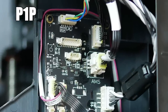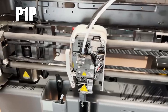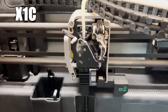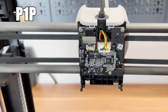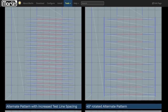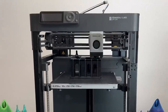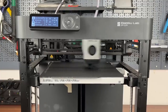That's mainly because of restrictive limitations. The toolhead, including all PCBs and interfaces as well as the front cover, is proprietary for the P1P. Electronic parts for the toolhead — like temperature sensor, heater, extruder, the fans, or hotend assemblies — are not interchangeable between P1P series and the X1 series, at least for now. What a pity for users already owning quite a lot of spares for the X1 series. The same applies for the Micro Lidar — don't expect an option for this on the P1P, as the mainboard is also proprietary. Concerning the lack of the Micro Lidar, there will be a manual way to determine the K-values for flow calibration, aka Linear Advance, just like on Marlin — but it's not available yet. After printing a range of different materials and filaments on the P1P and lacking a way to do the flow calibration, I didn't really miss it. The default values worked fine for the wide range of prints I made. Also for bed leveling, I didn't notice any trade-off yet on the P1P without the Micro Lidar in comparison to my X1 Carbons.